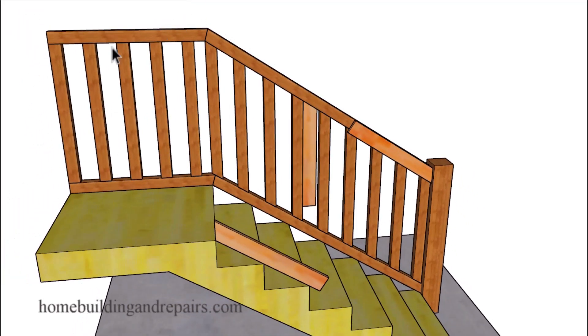Basically what we're looking at here is a 90-degree angle for our balusters — 90 degrees for top and bottom cuts. And then we have the angles here so that these boards will miter together. The baluster boards at the top and the bottom will be the same, along with the upper and lower rails if they're going to connect into a newel post.